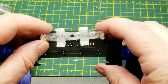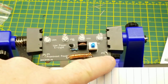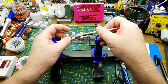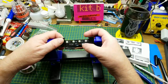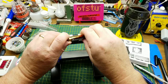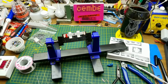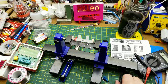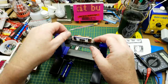That ought to be it — ready to go. JP1 is the positive side, JP2 is the negative, so I'll just mark that positive end so I don't forget. Are they making contact? Did I put it in backwards? So now I have to diagnose this. I found the problem — actually it was two problems. I had the positive on the wrong end. Fortunately, I didn't blow anything up.